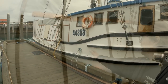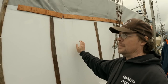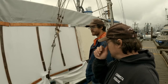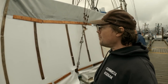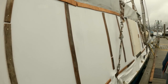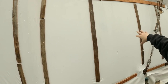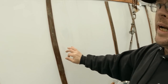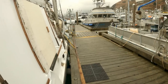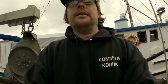We're all tented up for our big project. It's white vinyl plastic — you put it on and hit it with heat and it shrinks up tight. It's really durable — seven mil thick, tough as nails. We had some 50-knot winds a couple of days ago and you can't even tell. We also have tape for the seams that shrinks up too. We put slats where the framing is to keep large expanses from flapping, which would wear on the frame and start tears.